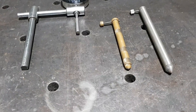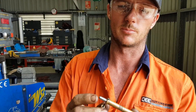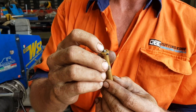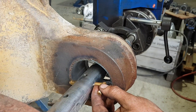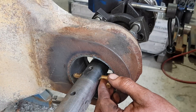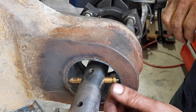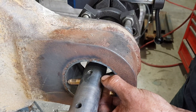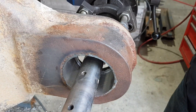So we're going to explain this snap gauge for everyone — everyone seems to ask how we measure these out. It's a spring-loaded gauge. You undo the little bolt and the anvil flies out. You've got a hardened ball on one end, hardened ball on the other end. Just slip it into the bar, feed the bar back into the bore you're trying to measure, undo the little screw, let the snap gauge come out, give it a bit of a wiggle to make sure it's found central, tighten it back up, and run it back out of the bore.